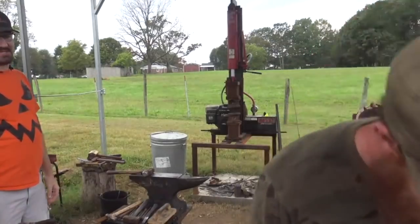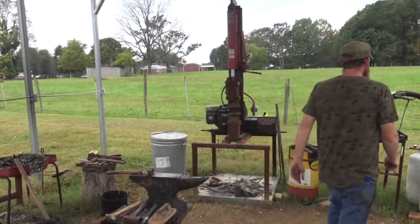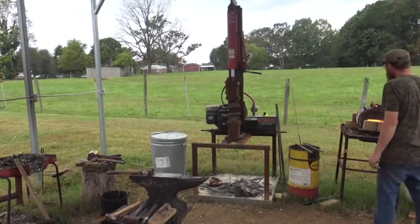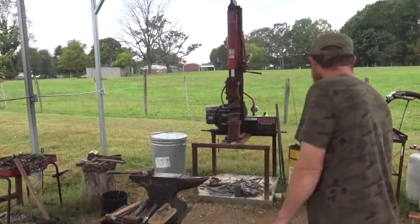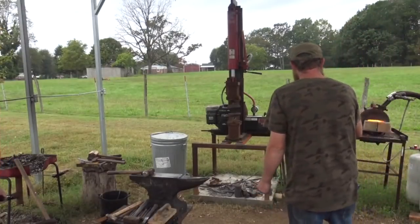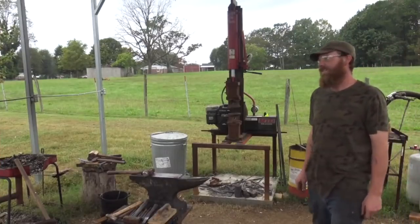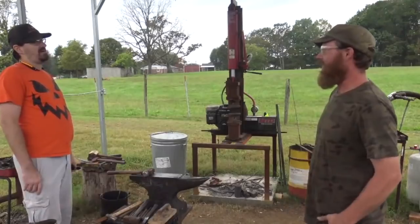I wasn't sure how much to use, and I didn't have a whole lot of time to cut it up the day I did that. We're going to crank the temperature up in here. Get it screaming. Like I said, I think I'm running a half-inch and it has a 10 psi regulator on there, so it does this at 4 or 5 psi. See how hot it is? It's so damn hot it's melting in front of my forge now. Yeah. I've got to rebuild this thing bad. It needs it bad. I don't think it'll last 6 months.